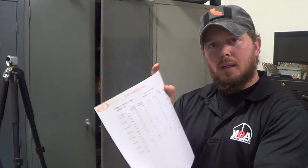All right. So for the first fire test on the second testing that we did, we failed the magnification. We were over 18 power by 0.1, not a big deal at all. We had zero aim point change. Where I do see an aim point change was the focus test. The focus test number 2, where we set the focus down to 100. We had an MOA change of 0.5, so half a minute of angle change.